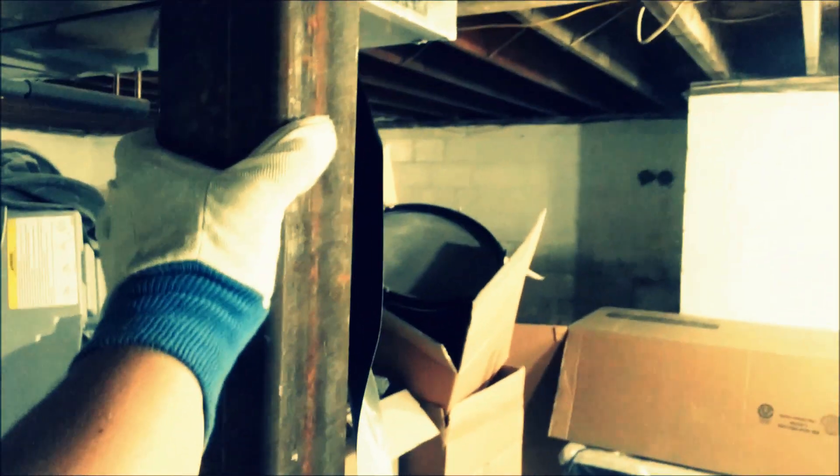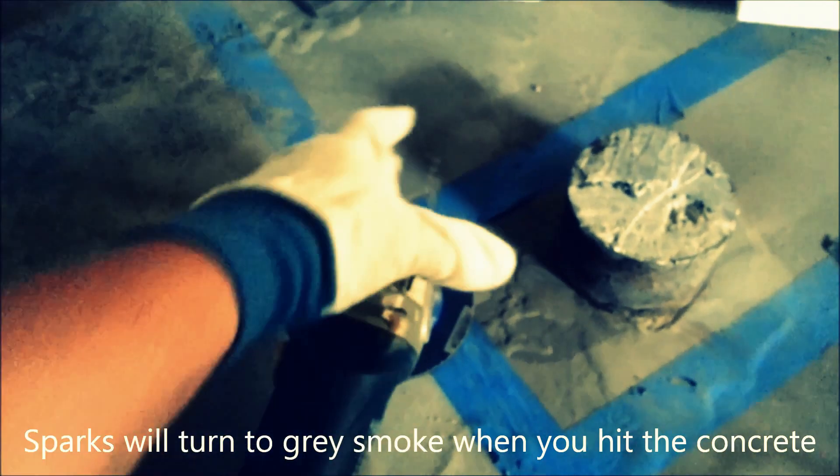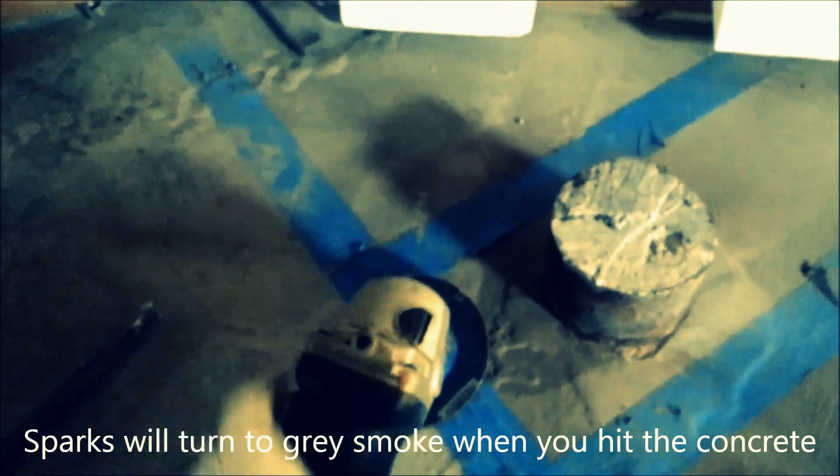You can see it down at the end - it was about a six-foot-five post, connected right here. I had to relocate it, so I got a new tube supporting over here, and you can see it quick-bolted down to the concrete. What ended up working was taking a four-and-a-half inch angle grinder with the metal cut-off and going lightly around so you only hit the steel. Through the steel, you'll notice as soon as you hit the concrete it just shreds the wheel - it will not cut through concrete.